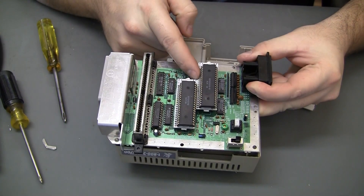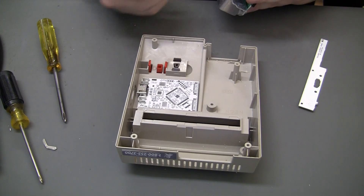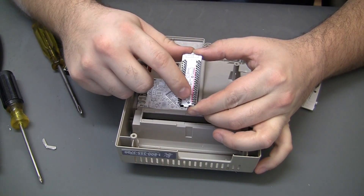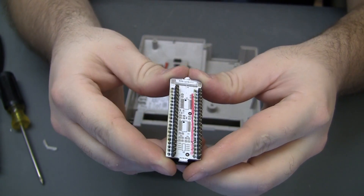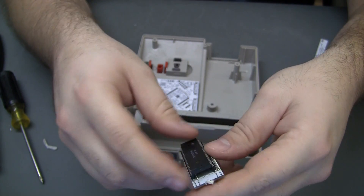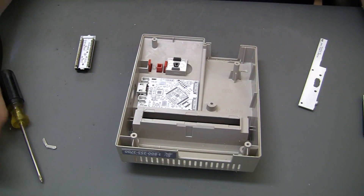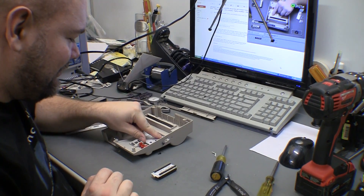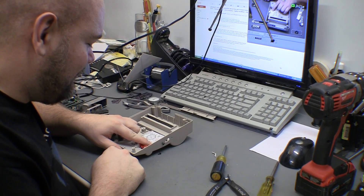The interposers are really touching right there - it'd be nice if the CPU was offset the other way. Also, I like to drag solder those connectors on there, and I notice when I do that my soldering iron might have the possibility of coming really close to a lot of those pins right there and bridging them. I really don't want to do that, so if they could be moved over that would be excellent. It wouldn't matter if they were moved to the top of the board because the same thing happens up there of course. Anyway, we're going to have to look at this a little better, maybe move the template to a different spot, and have another crack at it.